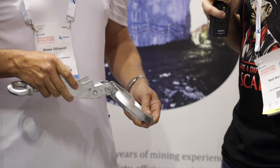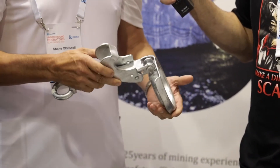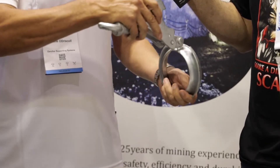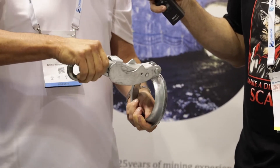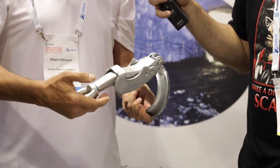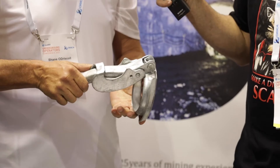I can't guess what this is — looks like something to castrate a bull. This is the Polito 110. You slide it onto the 110mm pipe and just drag it down the drive. If you want to stretch out poly, there's a swivel on there, a tie-off point. When you pull up to your end, you tie that off and then release it back off and unclip it and away you go. Tie it down the hole — no cutting holes in poly pipe, just whack that puppy on there and drag it.